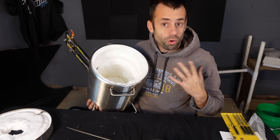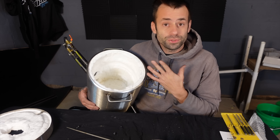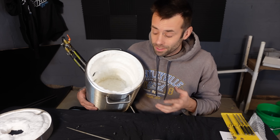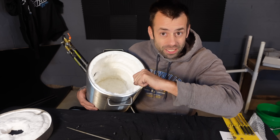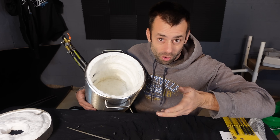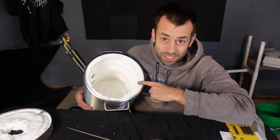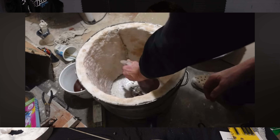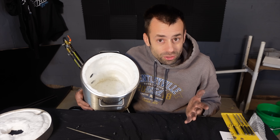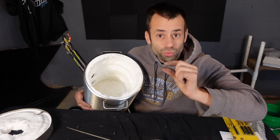Now it doesn't matter what brand you buy or if you build your own — the ceramic blanket is gonna come naked like this, so you've got to seal it or coat it with something. A very common product used is called rigidizer. I've used Ludox — it's a very clear liquid that when you spray it on, dries and holds everything together. It won't look like it's coated but it's treated so those fibers aren't gonna blow off. One tip: if you're spraying clear liquid on this stuff it's very hard to see, so I put food coloring in there, make it as dark as you can, then spray it on so you can see where it goes. Personally I don't like that as much because I'm lifting things in and out and it's a little more fragile — I like to have a more rigid crust on there.